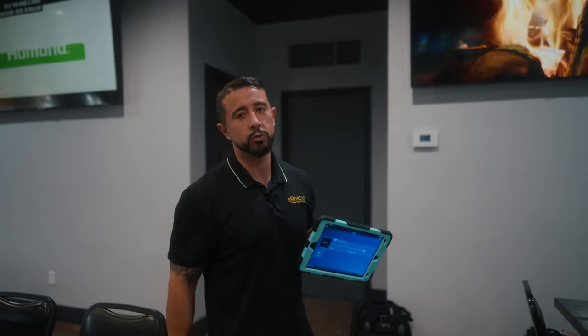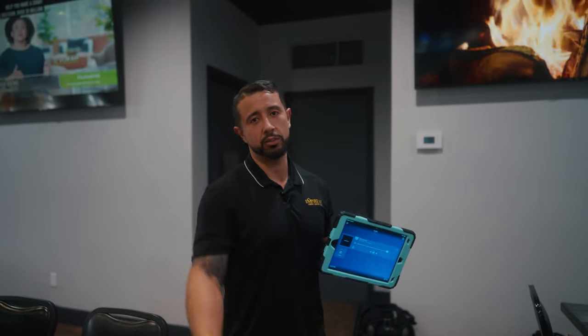This is dedicated for audio-video, but keep in mind that as we continue to program this system, one of the things we got today was opening and closing times. So just like all our other restaurants, this system is going to turn on at the selected opening time and turn off at closing to eliminate staff having to do all that. These are all 70-volt Episode in-ceiling speakers. You have to make sure your network is reliable and can handle everything, so we used commercial grade Araknis access points and created a guest network to make sure guests have Wi-Fi access but do not have access to the admin or POS system.